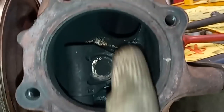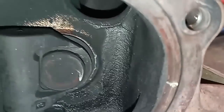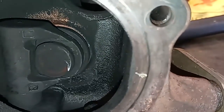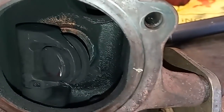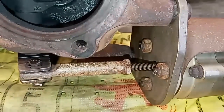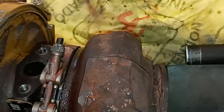How it does this is through the balance valve. You can see the port that goes to the larger scroll, and this sealed-off passage — which you might think is just a wastegate — is how it works. It actually opens by air pressure and balances out between both scrolls if the ECM wants it to. This allows it to vary turbocharger speed and also controls the amount of back pressure, which comes in handy when pushing exhaust gases into the intake — one of the key design features of this engine. The turbine housing also has slightly different sizes because the scroll sizes are different.